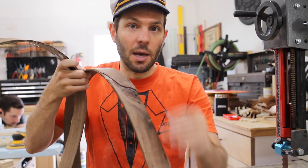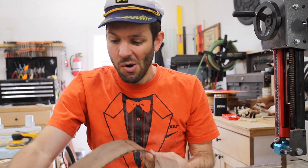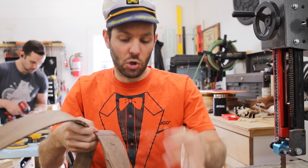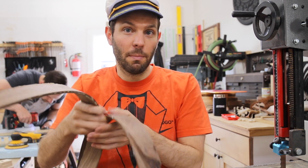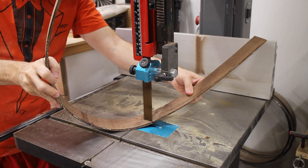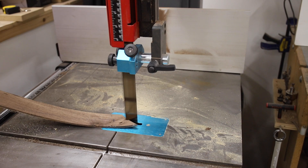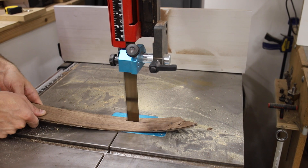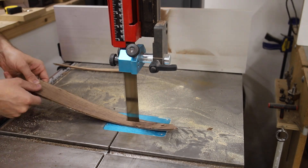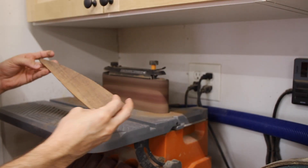We'll trim these up and see how it goes, carving them up — if they look good, great; if they need more trimming, we can just shorten them. As for forming the leaves, it really helps having a bandsaw and making sure that the flat part of the curve is where the blade is cutting. I'm sketching these as I go, trying to carve around knots along the edges of the boards and doing the final shaping with the sander. I'll show how we're going to attach these in just a bit.